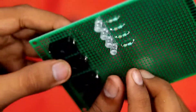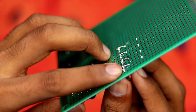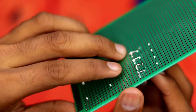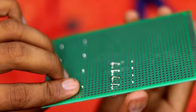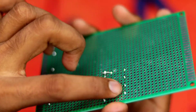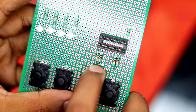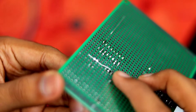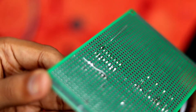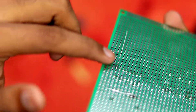I'll show you the back before it gets too messy. I've placed each resistor right next to its LED so I can use the resistor wire to connect directly to the negative side of the LED. Power comes in through the LED, out from the negative pin, through the resistor, and then to ground. At the back I've bent the wire from the last resistor toward the others so they can all be soldered together, giving me a single ground connection.